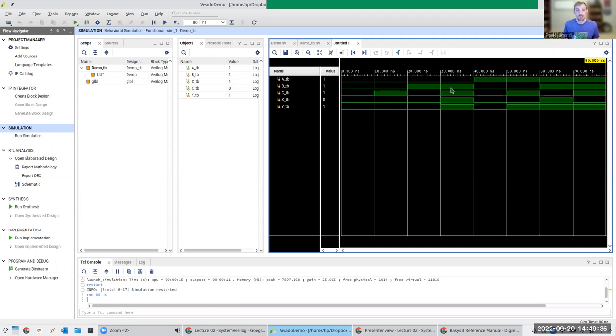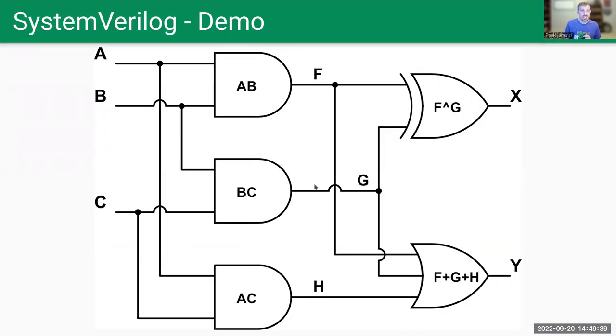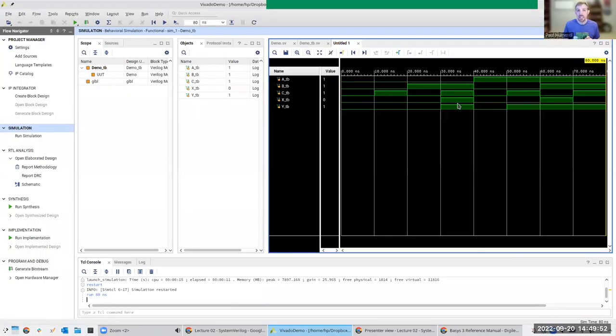And then here, once I have B and C, once this becomes a one, one exclusive OR, as long as this is a zero, which it is, this will be a one. Once this is a one, Y is going to be a one no matter what. And so we kind of see these happen. We could trace this through for all of these others. We could do every single test case to see what happens. And you should see that X and Y kind of fit.